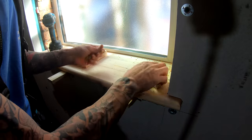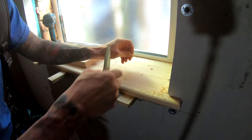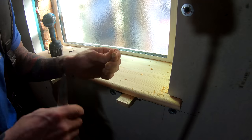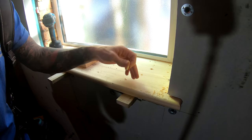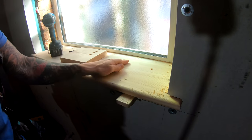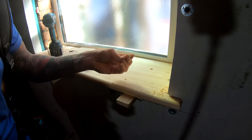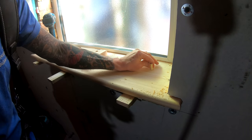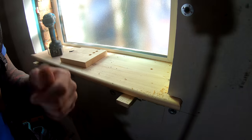All they do is just pop straight into that hole — put a little bit of glue in there. You can sand the edges down a bit, just give yourself a bit of a chamfer, and then just tap that in and that will cover over your screw. Once you fix this down, put the plug in, and you can just cut it straight off, give it a nice sand down, and you will never know. You can even be really careful and get the grain to go the same way, so if you do ever see the grain or if you decide to stain it, it looks like part of it.